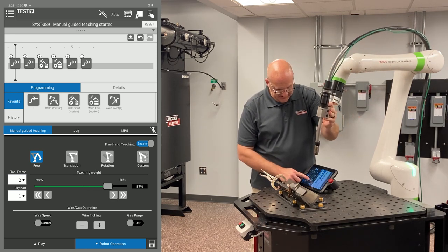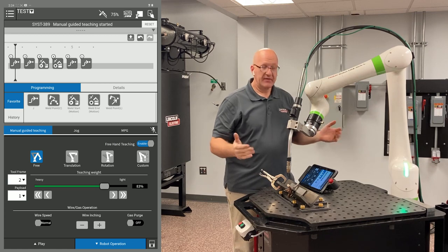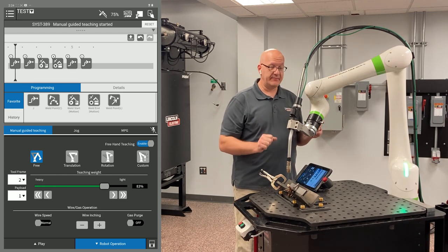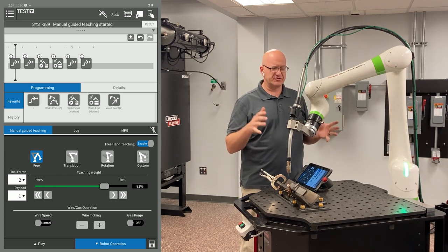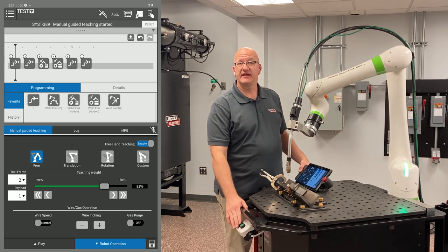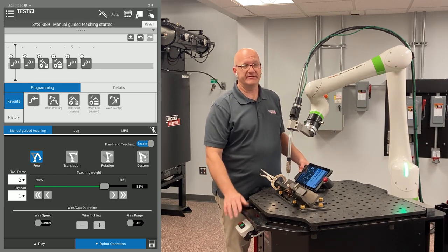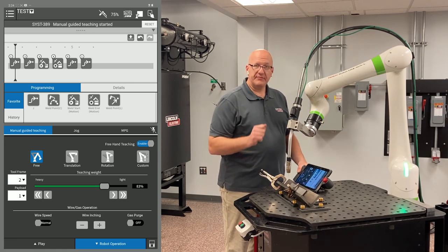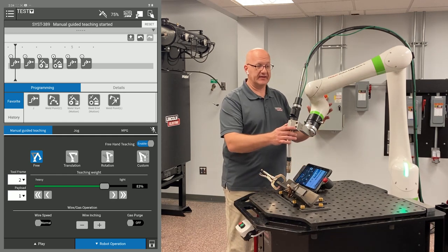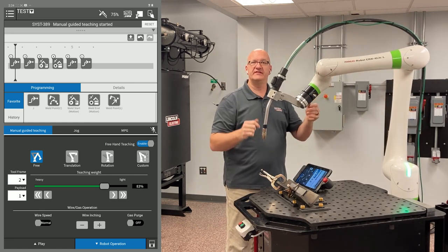In all other situations, I can run this up to probably 80% and then I can move it to wherever I want, and then it'll stay there. Now, if you lock the arm up — just like any other normal time when you're holding down the dead man — if I move the arm too fast and stop or do some jerk motion, it's going to lock the arm up. You're going to have to hit your red button if you have that set up. If not, see our video on tips and tricks where we show you how to set up a confirmed payload by hitting the red button — it's a great feature. So if you lock up the arm, you're going to have to hit the reset button and then enable the freehand teaching switch again. But once it is enabled, you can plot points moving the arm around without having to hold the dead man. So that's a great new feature.